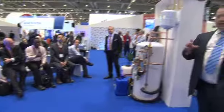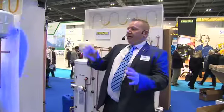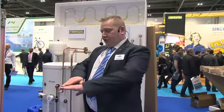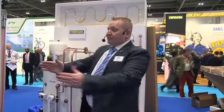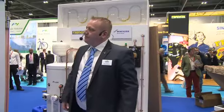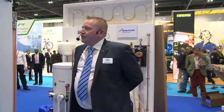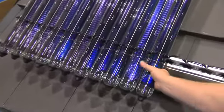Yeah, that's right. If we are south, for example, the sun comes up in the east and goes down in the west, as we know. Now, south facing is ideal because we can gather the irradiance all the way over. What we can do is if the roof is just slightly off, we can twist the tubes up to 20 degrees. So that way, if we're facing that way, in reality, the tubes are actually facing that way. Do you follow me? Because we actually twisted the tubes. Yeah, I understand. So in which case, you cannot do that to the panel. No, not the flat plate. No, that's right. We could also do east-west as well. We could do one on the east, one on the west, and gather the radiance as it comes over.